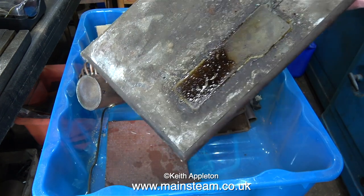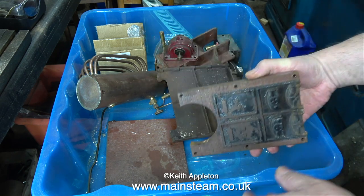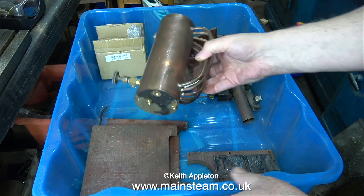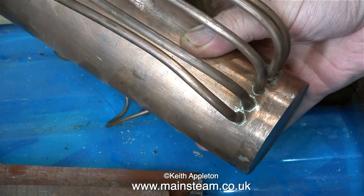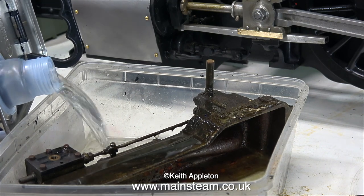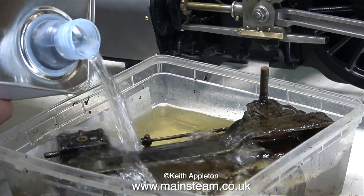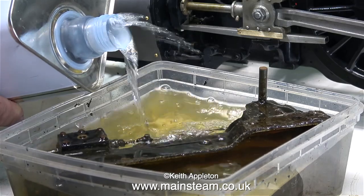This steam plant was partially dismantled so there's a box full of bits. I'll go through some of the parts: this is the rear boiler support — a very thick piece of cast iron. This is the other side plate and everything's in very good condition, a bit rusty and horrible but not broken. And here's the boiler — this is a Basset Lowke boiler. Basset Lowke boilers were very good and it's a Babcock type with water tubes underneath. I've put the engine in a plastic tub and I'm currently pouring cellulose thinners — known as lacquer thinner in the USA — into the tub and all over the engine. Usual health and safety warning: when using solvents, always use them in a very well ventilated area. My workbench is next to a wide open door which leads to the outer part of the workshop, right next to a fully wide open garage door.